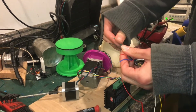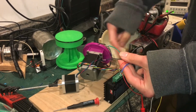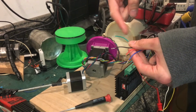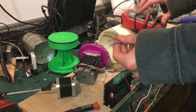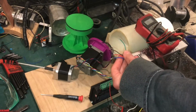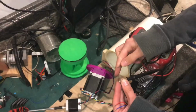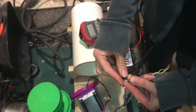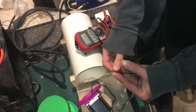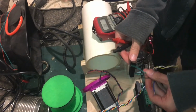you gotta imagine if you had inside the motor 100 turns. So it goes through the green wire into the motor, and then there's copper wires. And say there's 100 turns between the green and the black. And we're going to measure the ohms between those two. First of all, to prove that there is a coil between them. So I'm just touching one side with each probe of the meter, and it says 8.5 ohms. Okay. So the coil is 8.5 ohms.